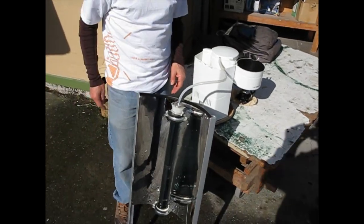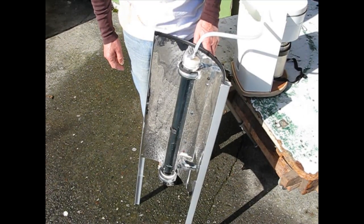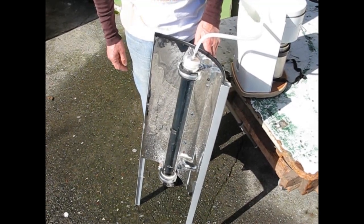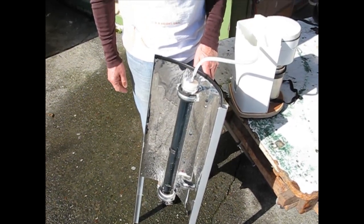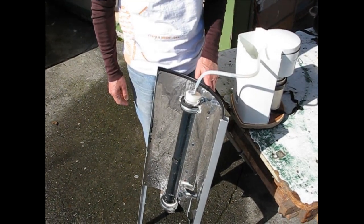In this thing here, we're going to heat up the water. It's like a thermos bottle. It's got a glass on the outside, a small evacuated space, and then a black surface. It doesn't re-emit infrared radiation, so once the sunlight goes in and heats that surface, it doesn't re-emit it. It's a selective surface.